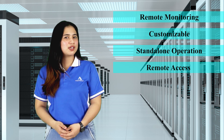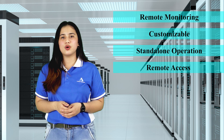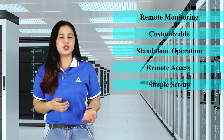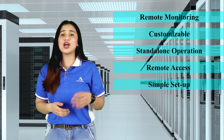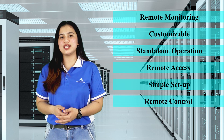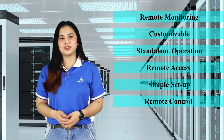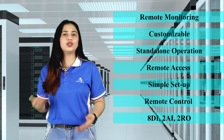The interface can be accessed by laptop, computer, or mobile phones. It is a one-time setup device with a user-friendly interface. REX can turn on and off devices remotely via logic expressions and SMS commands. It has 8 digital inputs, 2 analog inputs, and 2 relay outputs.